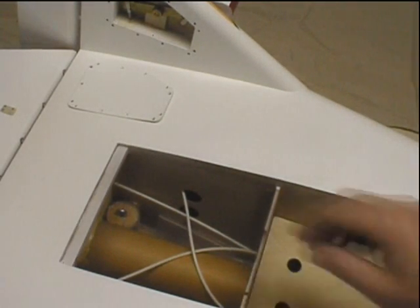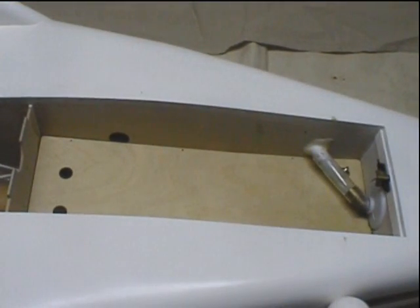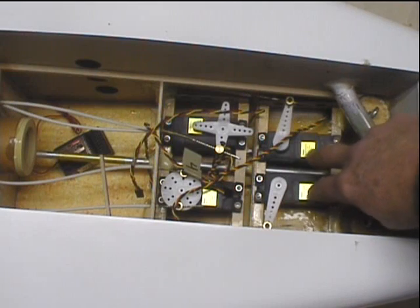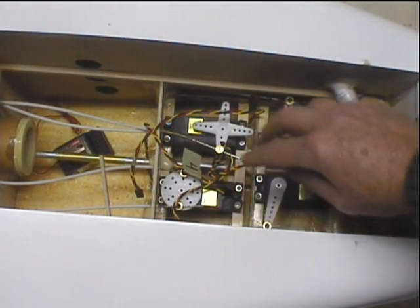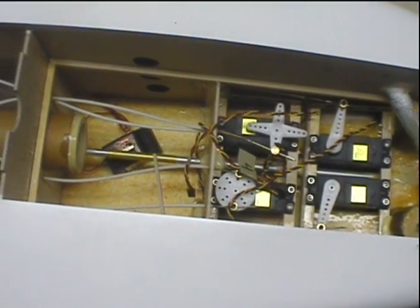Here's part of the rocket tube. I'll pull this cover off and show you what the guts of the model look like. Inside there are four giant-scale servos, each outputting torque of over 275 ounce-inches, so there's plenty of power because this model is going to be under a lot of stress going up. Those are for the elevons, rudder, and body flap. You can see the cables going out, and there's plenty of room for the batteries.